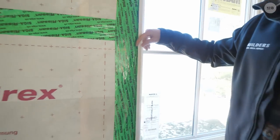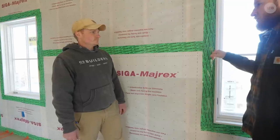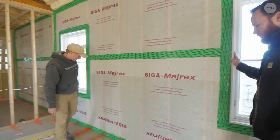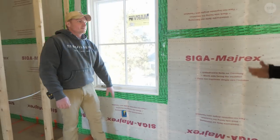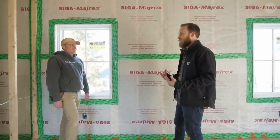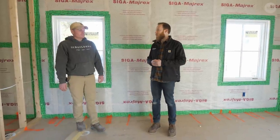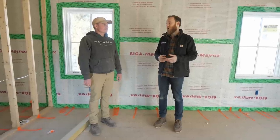In this home we're also working with AeroBarrier. We talked about back-caulking all our extension jambs to our framing, and Ken came out and said if you tape onto your extension jamb that's going to remove the need. We're insulated behind it but here's our air-sealing detail — you can air seal and we still have to go through in detail with best practices. You can see around our outlet here: we can take some tape and wrap it to seal up everything all the way around. The more air sealing we do now, the better our chances of getting under one ACH, which is our target — and this is a 1930s–1940s house.